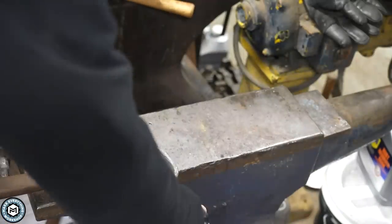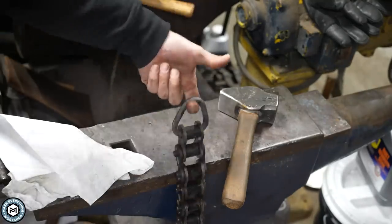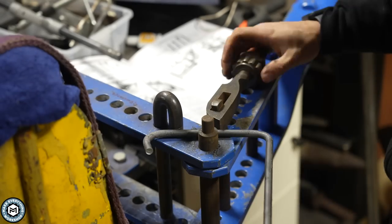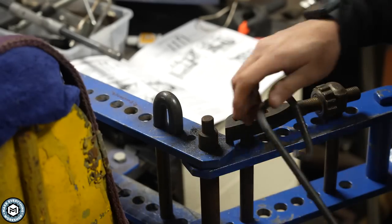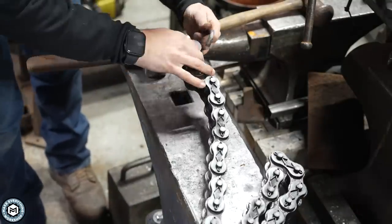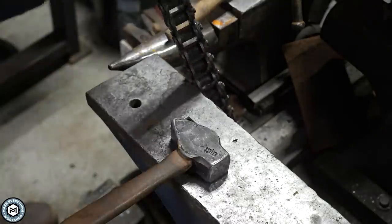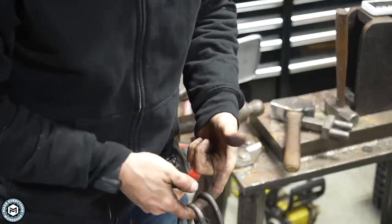You can see the metal carabiner sitting off to the side on the anvil. I give it a couple more taps with the hammer and make sure everything will move around and work together, and then I start on the other side, which needs essentially the same thing. Back over to the bender, I start bending the other hook using a slightly different method. I bend it a little bit less and then force it over with the hammer. Since I hadn't bent this over as much, I used lighter taps to guide it into place, then finesse it with the vise and hammer. I want this to still be able to move a little bit, and it's hard to do because this is three-eighths round bar, which has a lot of resistance when bending.